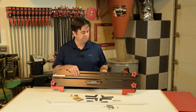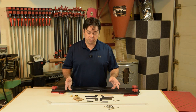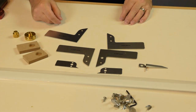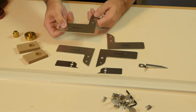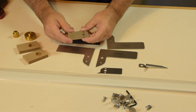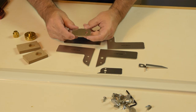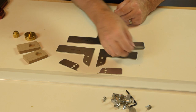Let's look at everything you get in the box for the Woodpeckers Exact Width Dado Jig. You have the jig body itself with large anodized aluminum assemblies that are really sturdy, and a good bit of assorted hardware. We have four clamping plates that mount to the body of the jig and give you a nice spot for a small F-clamp. We also have stop plates that function when using the jig for stop dados - they stop your router base in a predetermined location, and also function as a pointer that lines up with the scale built into the jig.